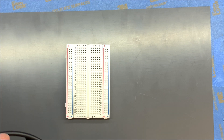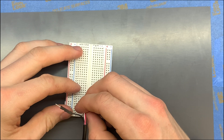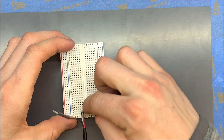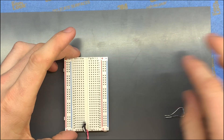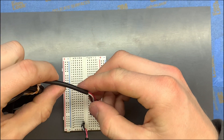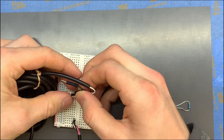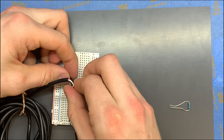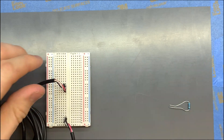The first thing we're going to want to do is get all three of our temperature sensors hooked in. I like to put them along the inner edge along the channel in the middle of the board. Place them in the order of power, data, ground. We'll do the same thing for each of the three sensors — power, data, ground for all three.